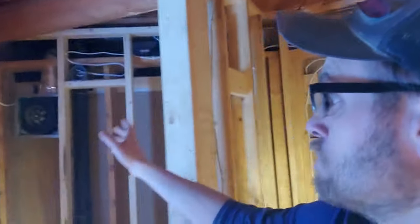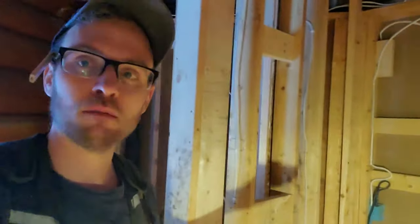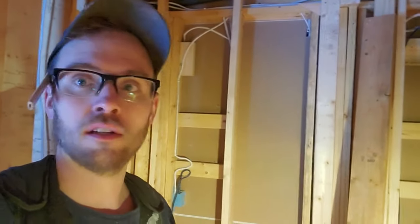The economics sway in favor of the structural screw because all I have to do is move one stud and the cost of those screws has been immediately offset. Things had to be tested a little bit here and there — screws in, out. Beautiful. No waste, no garbage, no firewood. So that's my case for yes, you can frame with screws where appropriate. In small home renovations — kitchen, bath — it's appropriate. If you're just doing a plain old stud wall at 16 inches on center with no mechanical wiring issues, get your nail gun out.